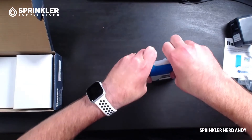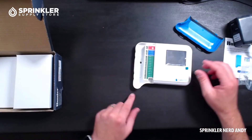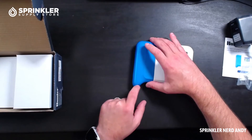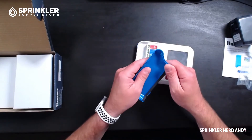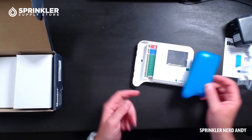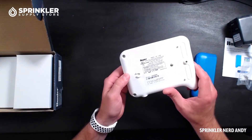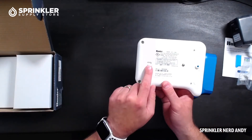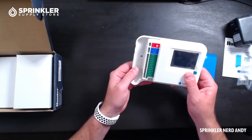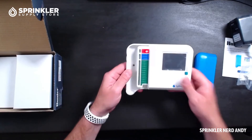You can see inside the controller. What's kind of cool is this bottom water droplet edge — you can run conduit right to here, and it's scored so you can take a knife or box cutter and cut it off. I'd recommend removing the cover, cutting one side then the other, so you can run conduit in for your field wires. There's a pre-drilled hole here for mounting — use that first hole, drill or put your wall anchor in, level it, then put the second screw in.